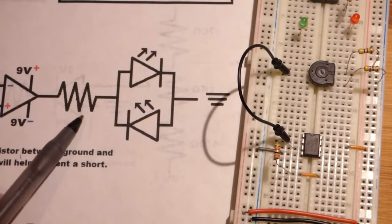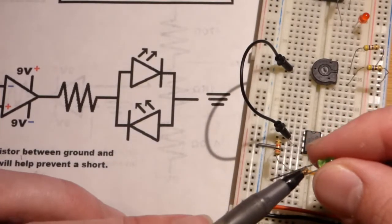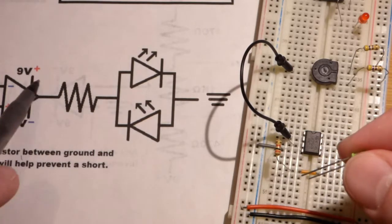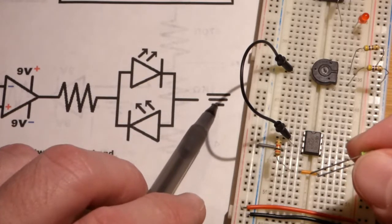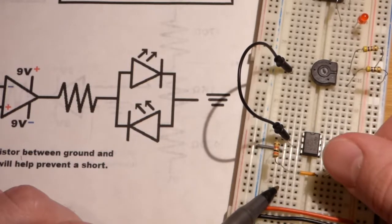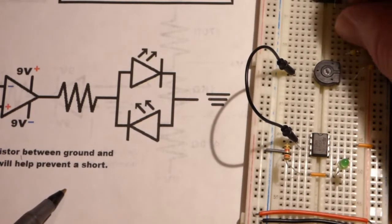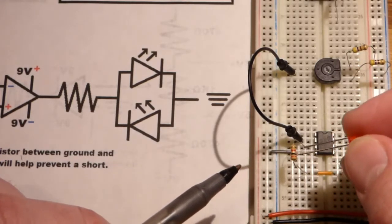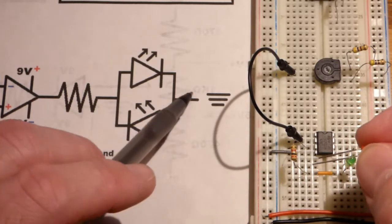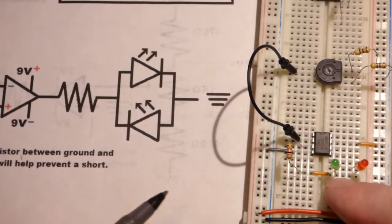It's going to give us a good visual of what's going on when it comes to voltage and current. So the green LED I'm going to set so that it conducts when the output's more positive. So if the output's more positive, then a current will flow through the resistor, and then the green LED. So I'm going to put the longer lead closer to the output of the trim pot. Shorter lead I'm going to put to ground. Shorter lead's the cathode, longer lead is the anode, and of course the red LED I'm going to do the opposite. So the long lead, the anode, I'm going to put to ground, shorter lead the cathode, because when the output's more negative, that will allow the red LED to conduct. And so plug it into the same 2 rows there.